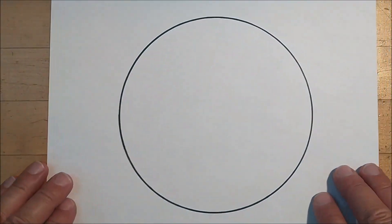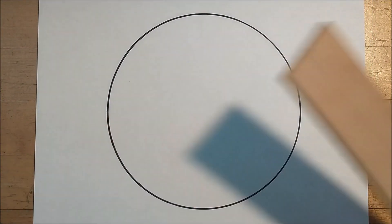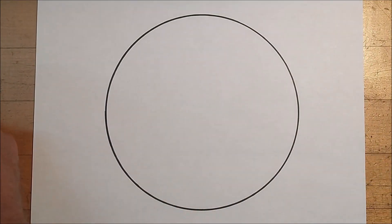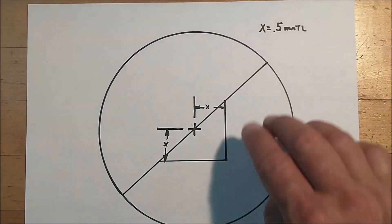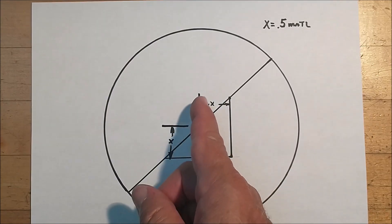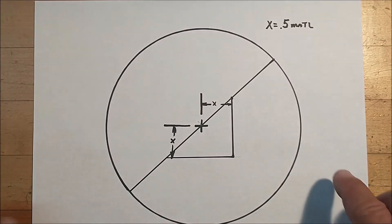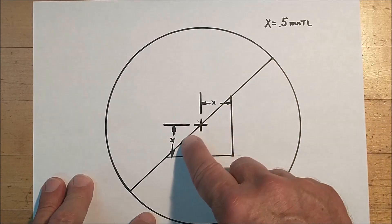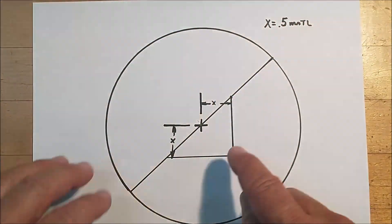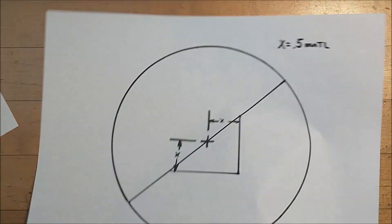Before I do it on the machine, I want to show you exactly what I'm going for, just so you understand what I'm saying. We're looking at the end of the stock here. Ultimately, what you want to have when you're done is a part that's 45 degrees with a notch in it, whereby that notch is equally off-center by half the material thickness right there. And at the very last step, we're going to cut some of that surface away, so there's a parting line and a compression line for deviation in the material. It's really not as hard as you may think.